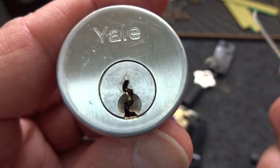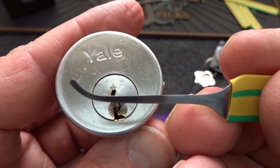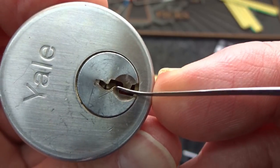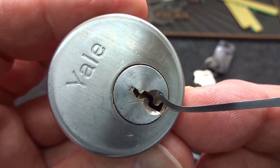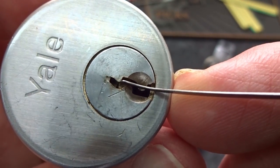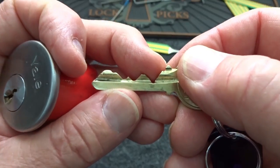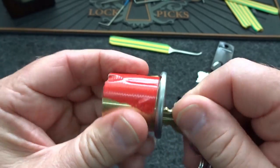The other thing is we have a paracentric keyway. If I'm forced to work from the bottom of the keyway — which I routinely do — I've been playing around with a .013" pick so I can get it into the keyway, get it around that curve, and sometimes curve it around in such a way that I can reach those very high cut pins. This lock doesn't allow that. Even with a .013" pick there's no way it's going to bend around that warding. Given these very high cut pins hiding behind the low cut pins, I probably wouldn't have been able to pick it anyway.